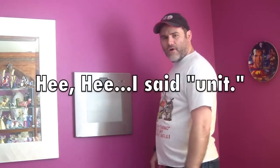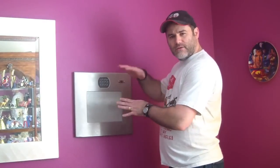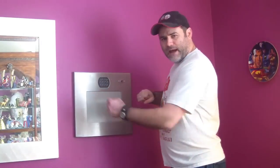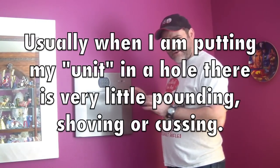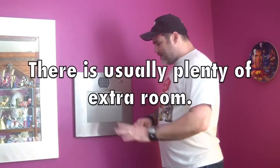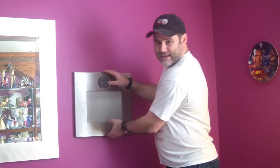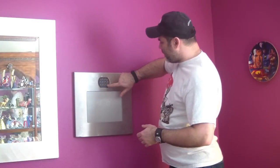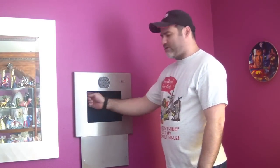I have taken the unit and sat it in the hole. I laid a piece of wool velvet insulation over the back of the safe and slid it in. I won't spare you all the pounding and shoving and cussing it took — there are little screws on the sides of the case that make it just a hair wider than the space between the studs, so it just takes a little brute force. Rather than marking holes, pre-drilling, and pulling it back out as the instructions say, I just used self-tapping screws through the open safe door directly into the studs — four screws, one in each corner. Self-tapping, won't split your two-by-fours at all.